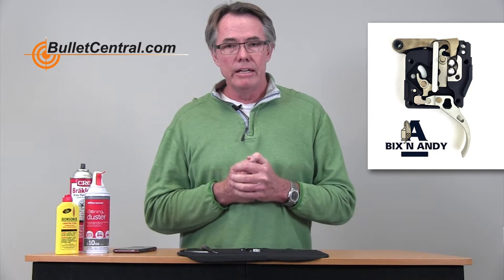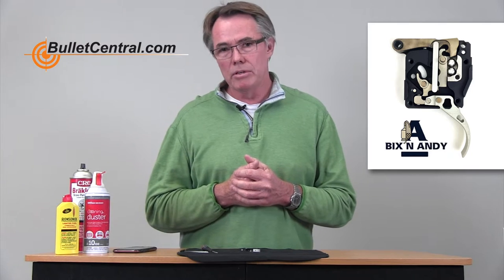In the past we've given you a video on a basic cleaning — just opening the trigger up, flushing some fluid through it, and making sure it's all dried out. But we've had two triggers back here that were malfunctioning. When I opened them up I found that in both cases there were tiny little particles of lint and some other crud that had been carried into the trigger from cleaning fluids — solvents that poured in and carried some little goodies down there, and the triggers weren't working reliably.